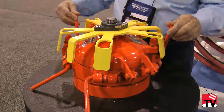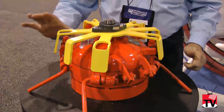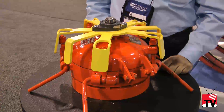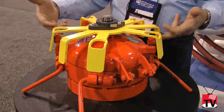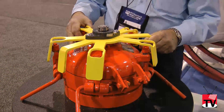The problem was that that wasn't being done. There were operators out there who would drop one and drop a bolt, then drop another and drop the bolt out of the lug. By the time they released three bolts — with only two on one side holding it — if there was still pressure in the vessel, the lid would blow up and people were drastically hurt.